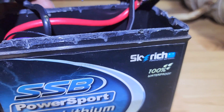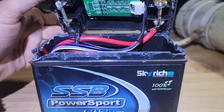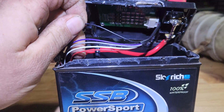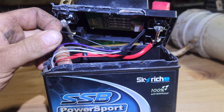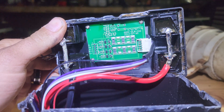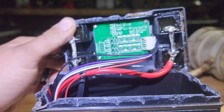That's it — just some light in here and a little pack of pouch cells down in there. You get a BMS, which is a 4S BMS. If you're trying to figure out what a battery is, count your BMS wires — start at your black wire and count the positives. It gives us four wires, so it's a four-cell battery. This BMS was manufactured in 2012, 7th month, 30th day from what I can tell.